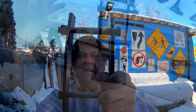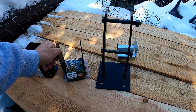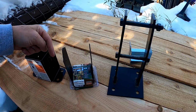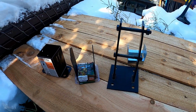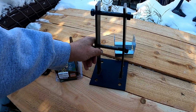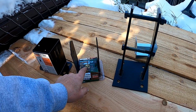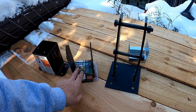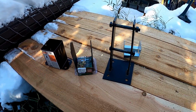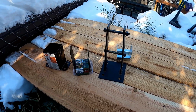Substantial steel. You can drill and get that into the post, but again, I don't know about hanging a gate on it too much, not unless you had the transom or the trellis across the top there, because the more weight you add, it's probably just going to start pulling the wedge anchors out, so you don't want that, right? If you're doing professionalism, let's do something nice above the top. That way you can get yourself a couple of 4-foot gates if you're doing a double gate or a single gate or whatever. The point is, you want to make it strong and substantial for these people, all right?